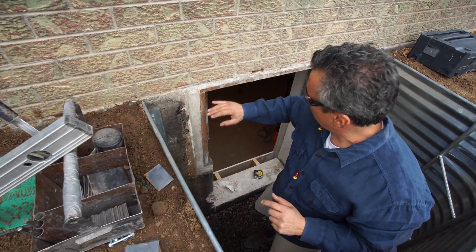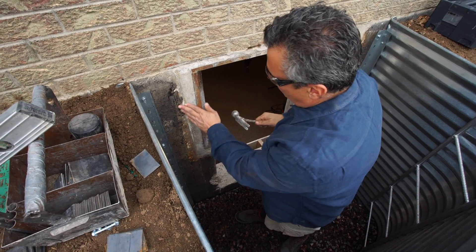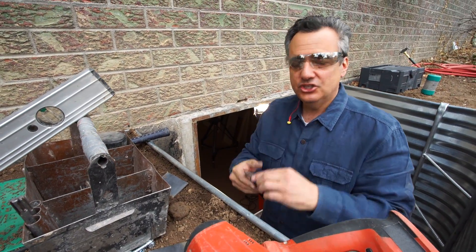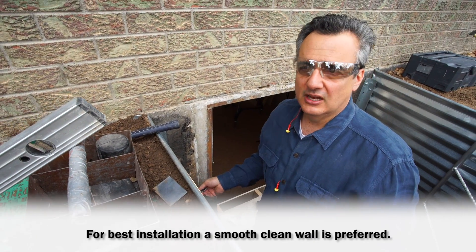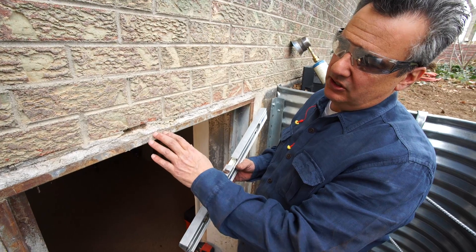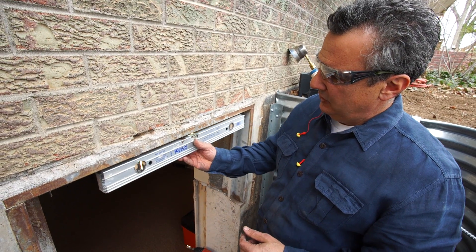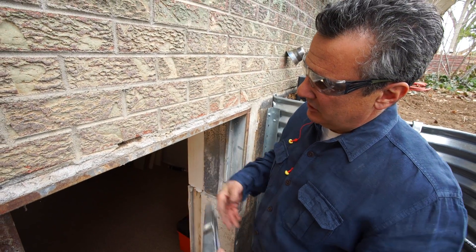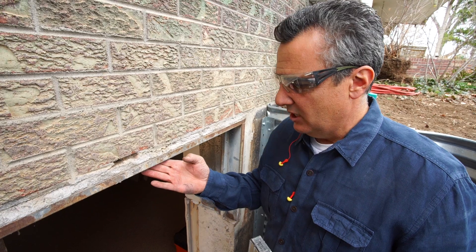If you see a little bump, just touch it with a hammer. We'll also take a shim and scrape the wall to make sure there are no burrs from mud and waterproofing that will hold the frame out. The benefits of the ExoFrame are numerous. This cast-in-place buck is bent sheet metal set into the foundation with concrete cast around it. Often these bucks begin to give way over time due to the load above, but the ExoFrame will mitigate that by touching the bottom of the buck directly or by shim.